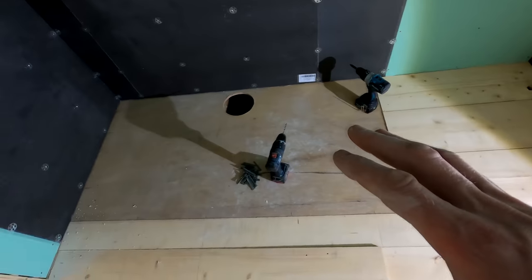We've got ply patches in here because that is where the shower tray is going to go. There's a wide area here for the waste so the plumbers can do their connections in there when we drop this tray on. We're actually using elements board in here as well on the walls as part of our waterproofing system. This is a really, really great product that we like to use. It's pretty straightforward to use.